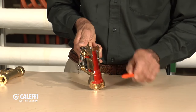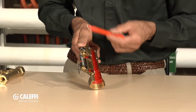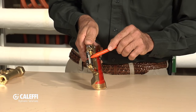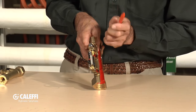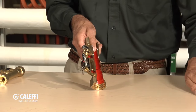What's important about that is the fluid never goes through the window, so this window's never going to get dirty. If you want to come back years later and make an adjustment, you pull the ring, the piston moves up and down again, it moves the ball with it. You change your setting with your fingernail on the arrow to where you want to move to. Then you put a wrench on this little stem here — that's where you adjust the flow rate until you get the ball lined up with the red arrow, and then you're set and ready to go.